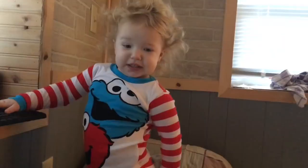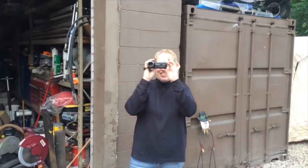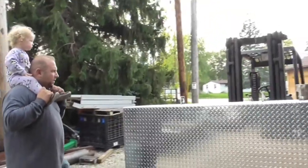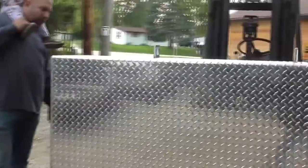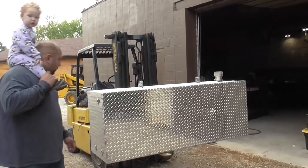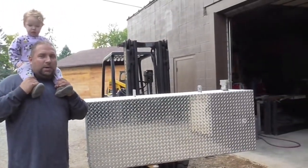We got this tank in here - a customer dropped off a 200-gallon water tank, custom-built. He doesn't like the way these razor-sharp lifting lugs turned out, and he doesn't like the sprinkler system the builder added so he can water everything while it's in the back of his truck. There are a few pinholes in there. Nice job on the brake press and cut, nice fit-up, but unfortunately everything is wire welded without pulse, with cold starts and stops, and probably no preheat - that's where some cold fusion and pinholes came in.